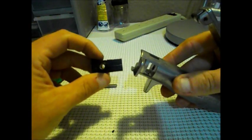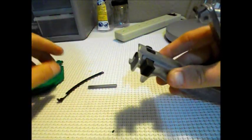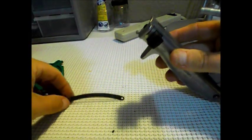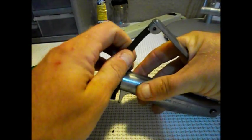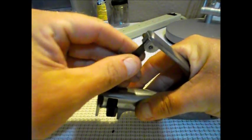We're going to go ahead and place in our collet. Get that in place. Everything's good there. So now we'll actually put in our press bar. It slips right in there. And then we're going to install the retaining arm. And this is what keeps it from overextending and actually losing contact with the pivot arm.